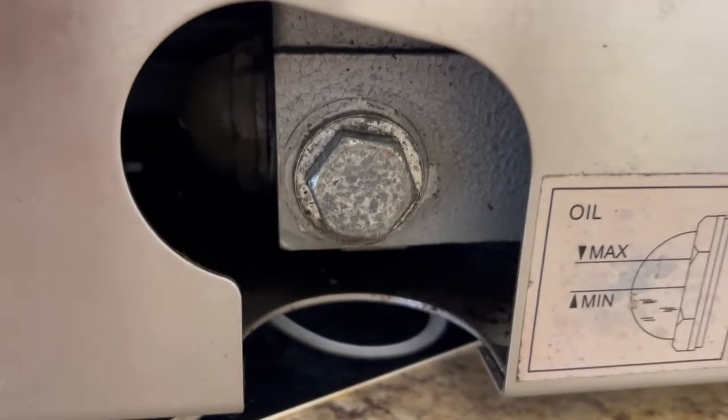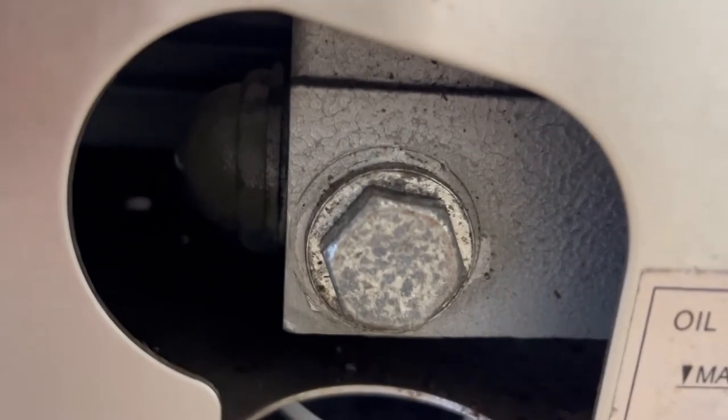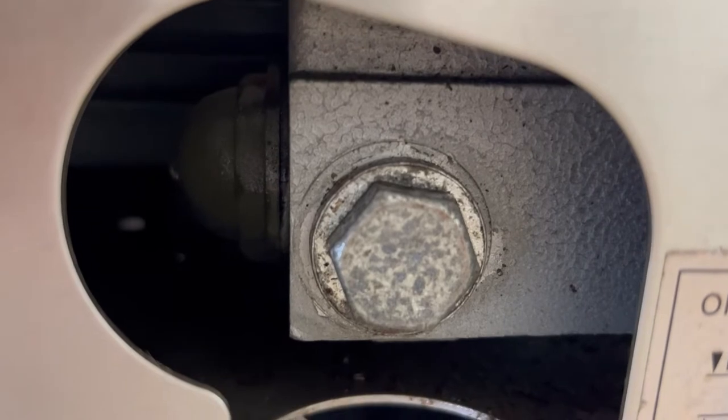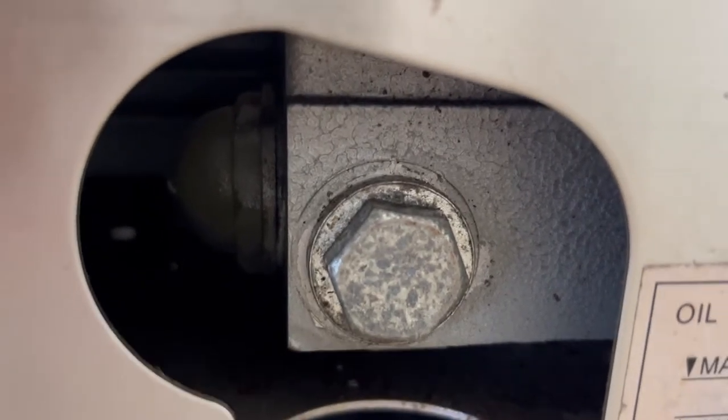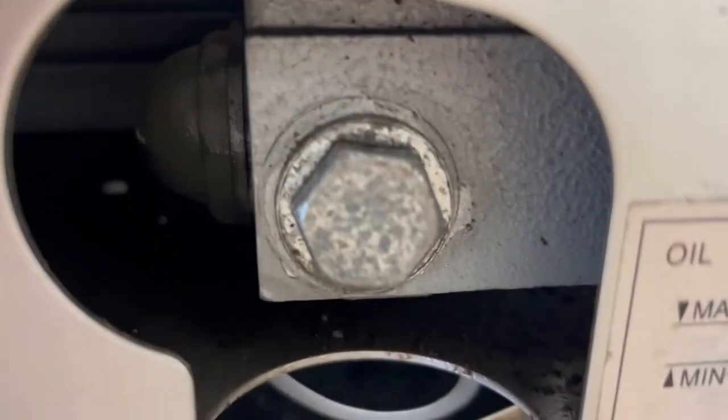Drain all the oil out. You can get this off with a standard lug wrench. That seems like kind of an awkward gauge, but actually a standard lug wrench is all you need. That'll get it right off. It's the perfect size. But drain all the oil out, and then fill it to the point where you think it's about halfway. And if you look in your instruction manual, it shows you what the capacity is, and you'll be able to kind of guesstimate. If you wind up with a unit like mine that's got a cloudy sight glass, maybe if you get something new, they've improved that and gotten rid of that, and you'll actually be able to see and you won't have to guess. But in any case, I've never had an issue with it. I think that's upside down.